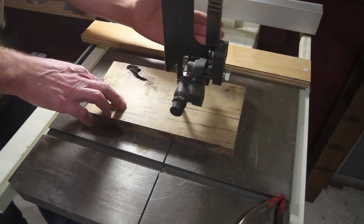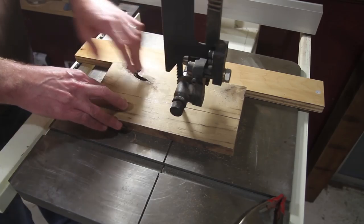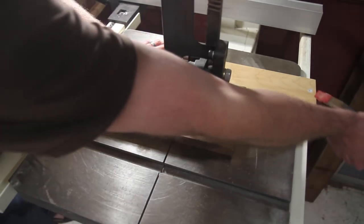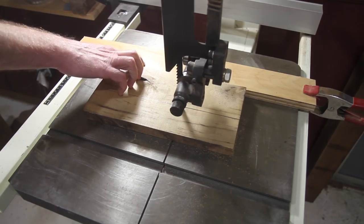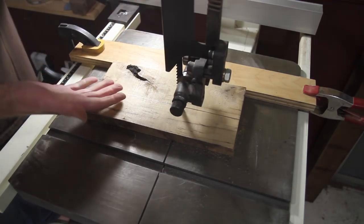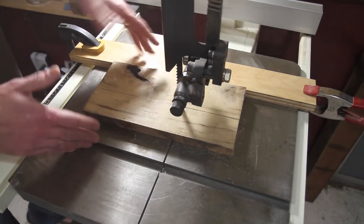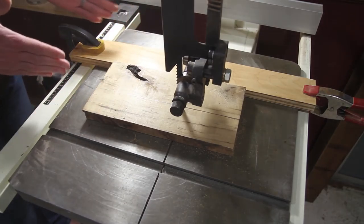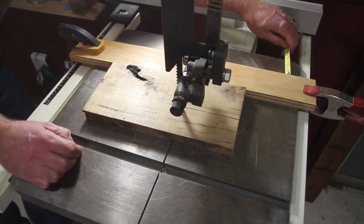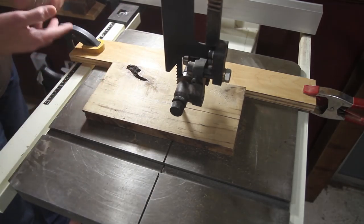If I were to slide the fence back over, you'd see that it hits here before it hits here. What you do is take a straight board and bring it over like that, lock that down, come over on the other side, clamp and lock this down. So if you're re-sawing a big piece like that seven inch piece, you'd do the same thing but just make a taller fence. You need to figure out what the drift is - right here we're a little under three inches, and over here we're a little under three and a half, but it'll follow that line all the way down.